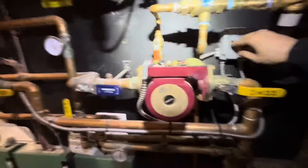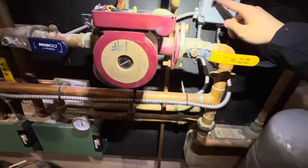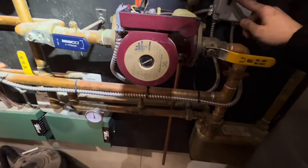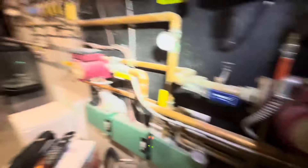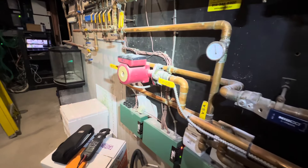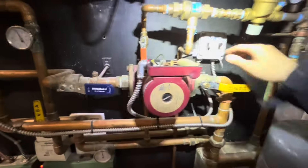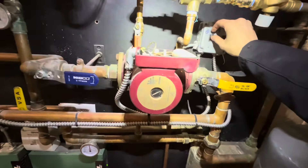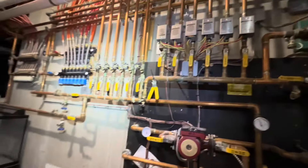If I turn off power and turn it back on — you hear that? That's not a good sound. This circulator's got to go. This other circulator, however, isn't making that noise — it's just this one right here. This is going to be an issue, and whether it is the exact cause I'm not 100% sure, but we also know we have that bad zone valve.